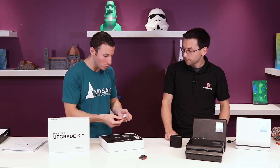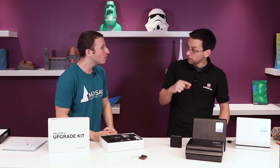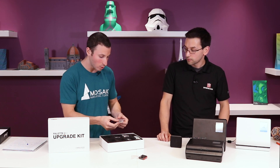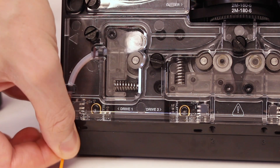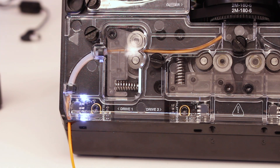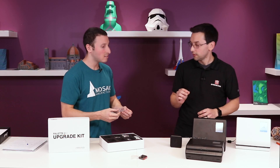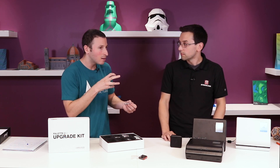With that, we have four new Splice Tubes that are compatible with that core — they are different Splice Tubes than the previous ones, so they'll come with the compatible ones. Next up, we have new Drive Arms. The Drive Arms are now almost clear, so you have a little more transparency into seeing the filament path. They also offer better constraint to the filament, which is better for precision control of driving the filament, especially with softer materials. Flexibles like TPU or even some soluble supports — PVA is kind of mushy.